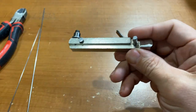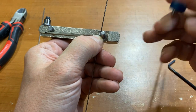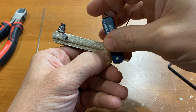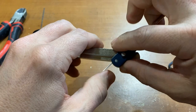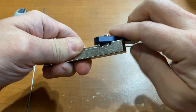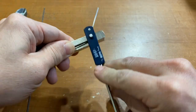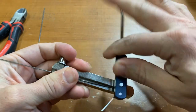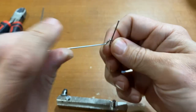Let's take our wire — we want a good inch, inch and a half out of the top, thereabouts. This other piece has a hole and a pin. We want the pin on this side of the wire because we're going to make our first bend by pushing it this way. We'll make that bend just like that. The pin is below, so we pull this up and bring that pin over the top, continuing all the way around until it's a little over 90 degrees — it'll bend back a bit. Looks something like that.